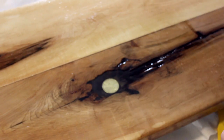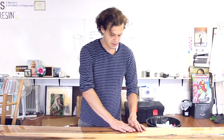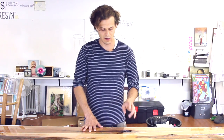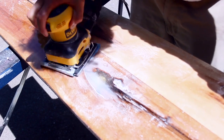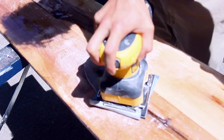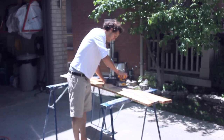What I'm going to do now is fill up these cracks so that every single crack and dent is totally flush with the surface — that's the second coat. I'm going to wait till that dries, then sand the whole thing down with a power sander just to give our final coat something to grip onto and to make sure everything is nice and level, so the final coat will have a flat surface to be applied onto.